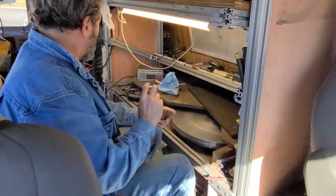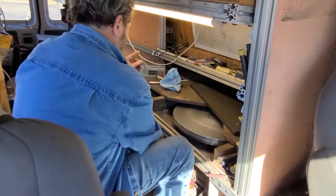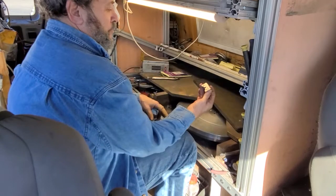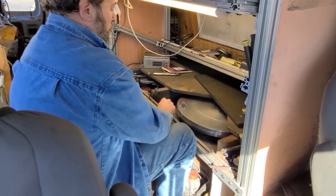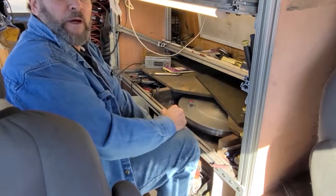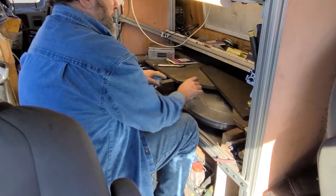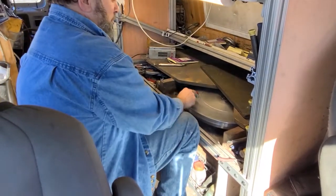It does. Another thing that I'm doing when I'm grinding is, as I'm moving my cutters particularly, as I'm doing the grind, I'm using a heavier weight pressure here than I do in here. So I'm maybe down about a half a pound. So you're pressing harder when you get to the outside of the wheel? I would do my normal pressure on the outside of the wheel, and then I lighten up when I get to the inside. How much pressure would you say you're using? About a pound and a half.